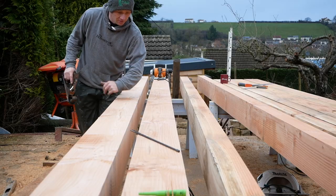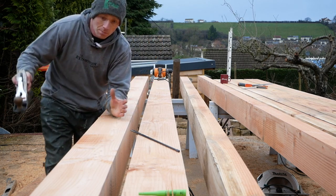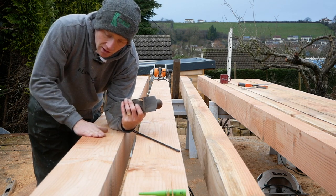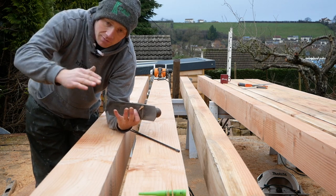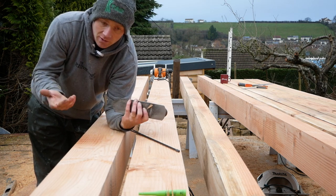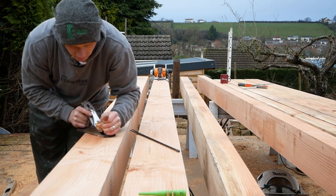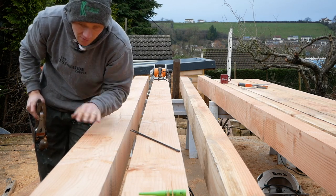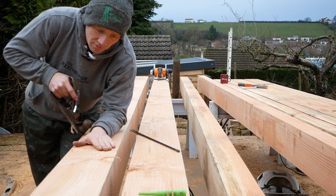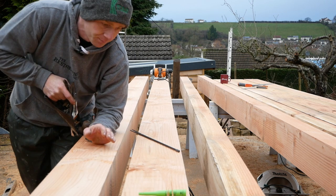Day two has gone okay so far. Nearly everything apart from our big ridge beam has been planed with the electric planer because it's got a really long bed — it means you miss out on these hollows. I say hollows, they're only about a millimeter or two below the rest. Because the timber is so wide you'd have to do several passes and reduce the whole thing down just to address them. Since we don't need perfectly square or perfectly uniform timbers for timber framing, I can just come in and take out the sawmill marks to get a consistent smooth finish. You could keep going and sand it, but I'm happy with a planed finish, and then we can put a little chamfer on with the router just before we raise it.